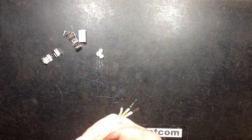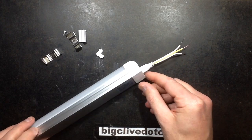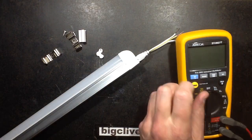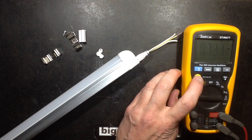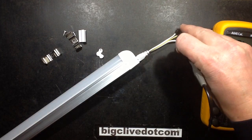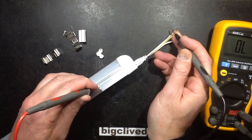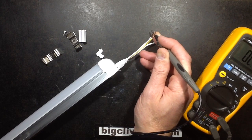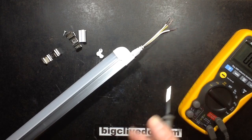Having ascertained that it is actually aluminium, I'm going to plug this in and check the middle wire — tagged with yellow — is actually earth and that it's connected to the casing. I'll get the meter out and put it to continuity buzzer, touch it onto the middle wire and to the case. Earth to the case — that's good. I'll touch it to the pin at the other end as well. Yes, it has continuity right through — that's good.